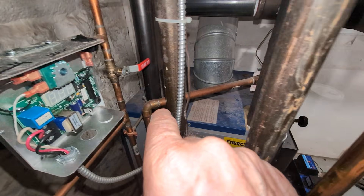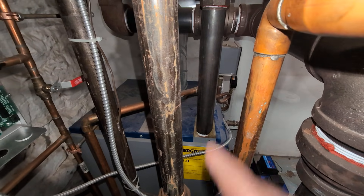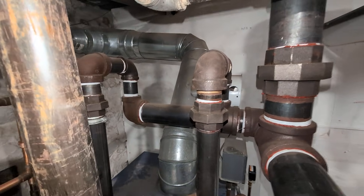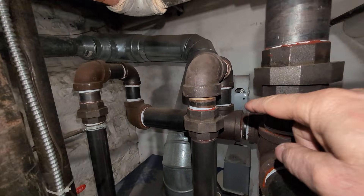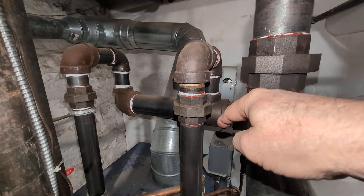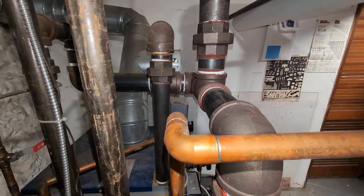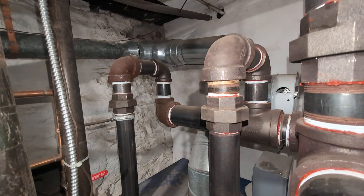You have two outlets here. Typical Columbia/Dunkirk-style boilers like to come out the side, but this one is nice because it comes out the top. Both two-inch outlets were used because we wanted the driest steam possible, and we used the drop header. The drop header requires two extra 90s and two extra nipples to allow the steam to come in at the top; any water then runs down the bottom and through this lovely three-inch header, which we oversized — the instructions allow for two and a half. We went the extra for this one because of the vapor system. We even used cast iron fittings in some cases.